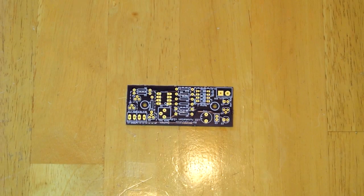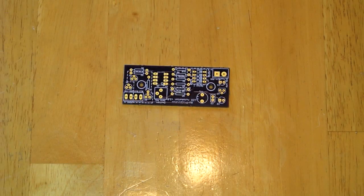The first step is to populate this board with all the resistors. I'm using metal film 1% resistors simply because they don't cost that much more than carbon resistors and they're actually better. The only issue is the color codes are a little harder to decipher, so it might be better to leave them in the little packets until you're ready to use them.